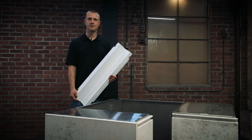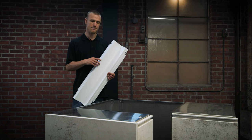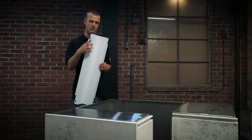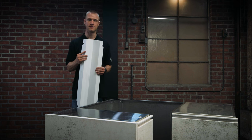Now that we have the OAR-90 panel assembly complete, we're going to begin the OAF-90 Angle Front Filler Corner Assembly. Making sure that our dog bones are pointed toward the floor, the larger side of the dog bones. We're hooking the corner filler onto the adjacent cabinets in the front.